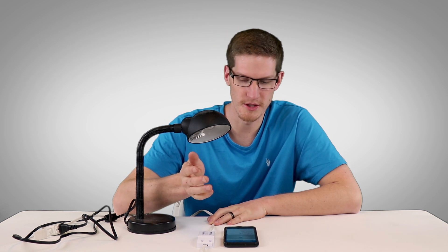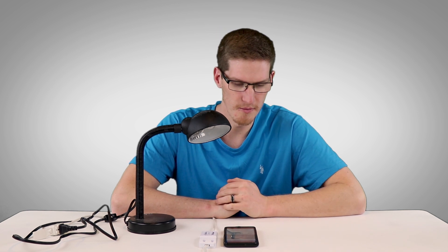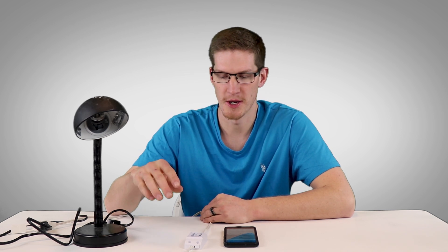So there we go — a less-than-five-dollar smart switch if you order straight from ITEAD, programmable with SmartThings to work with your home Wi-Fi. I've been running these for over a year without any real issues. The only issue I've seen: after a power outage when your network goes offline and the Sonoff goes offline too, when everything boots back up you may need to reboot the Sonoff, and in the worst case go back into the SmartApp and rediscover the device.